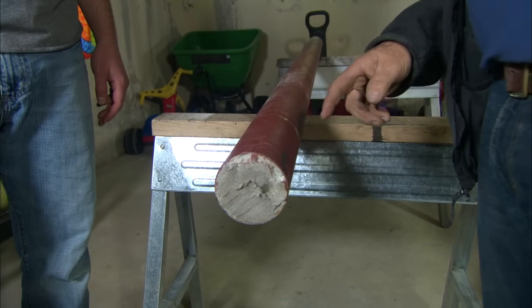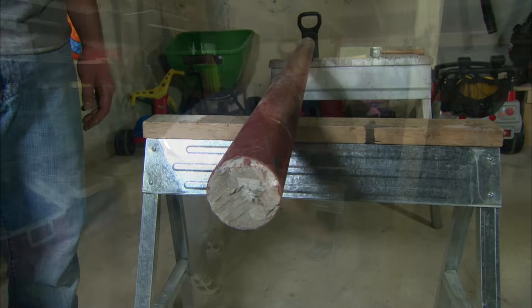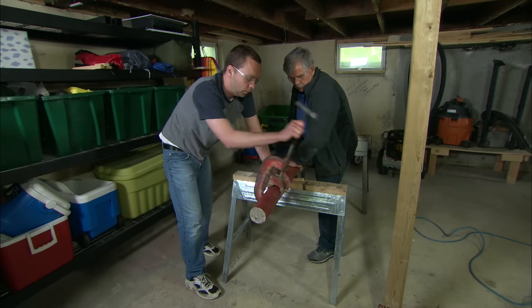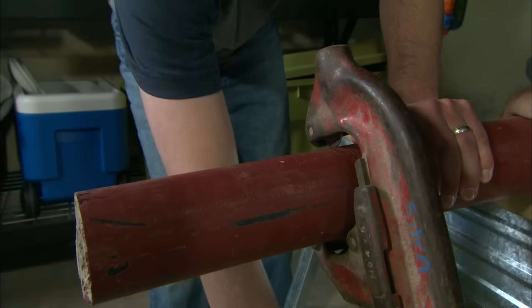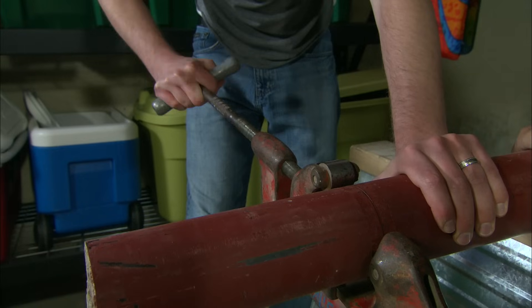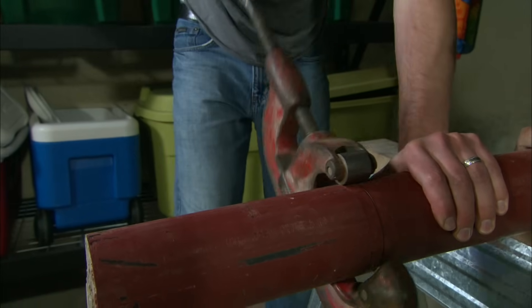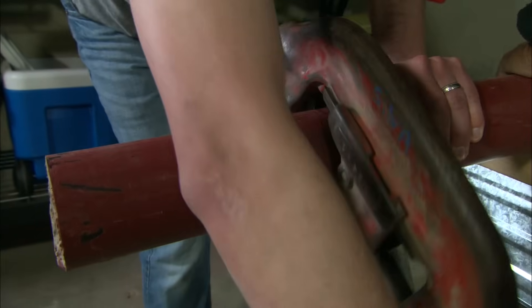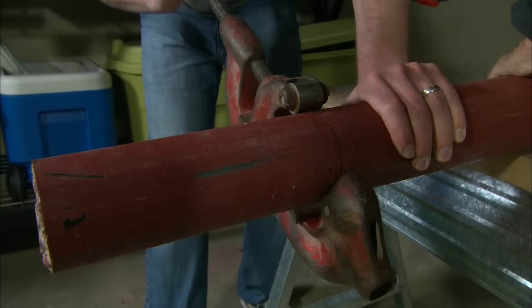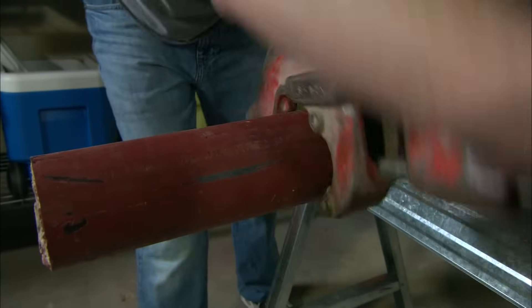It's not adjustable, so we have to cut it. We're going to cut it with a big pipe cutter. Have you used one of these? On copper pipe, sure. It's the same thing. Now give it a quarter turn, no more. If you tighten it too much, we can't hold it by hand — we'd have to get a big clamp on it.